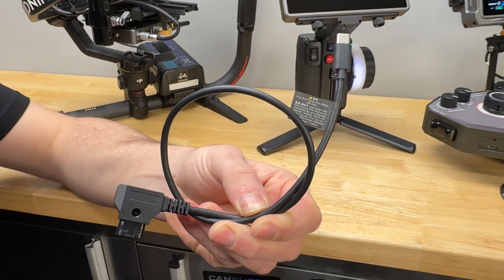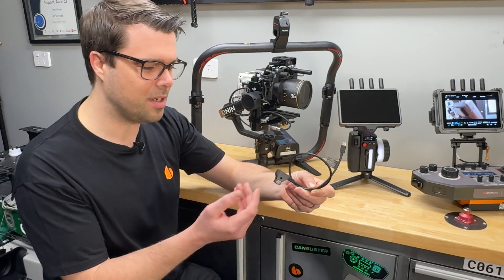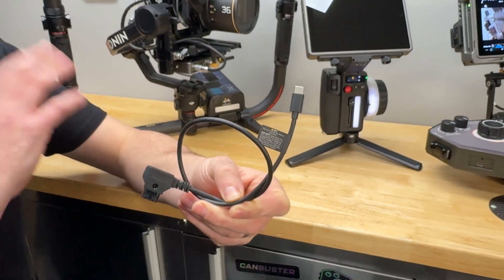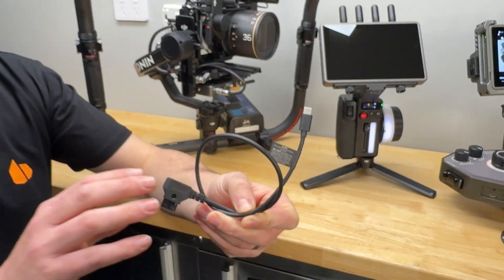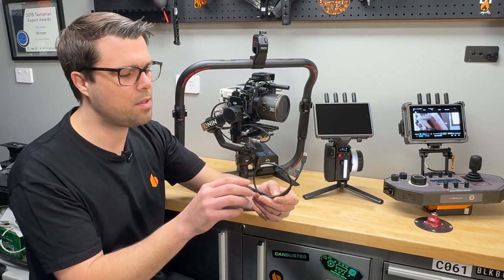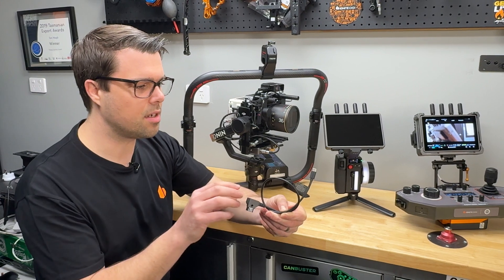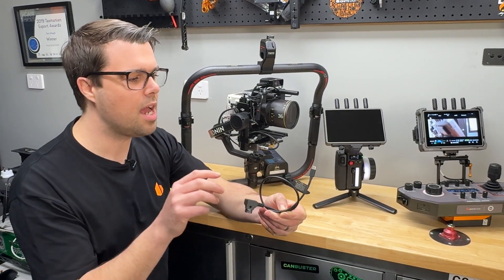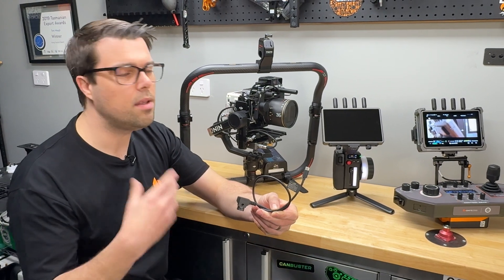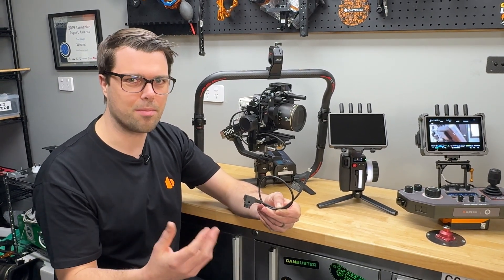For those who've got the Focus Pro motors, you'll have this D-Tap to USB-C cable. DJI do give you a warning about this cable, but I want to reiterate: this is a dangerous cable. It delivers 11 to 17 volts to USB-C, so use with caution. My recommendation — if your motors are already powered from another source, hide this cable, do not use it. DJI intended this for handheld setups running D-Tap into the motors. In a gimbal setup, you risk putting 17 volts back into the gimbal and frying the board. Similarly, if you're using the hand grip, power the motors from the hand grip — don't power from here and then feed the hand grip. You will smoke the hand grip. I can attest to that.